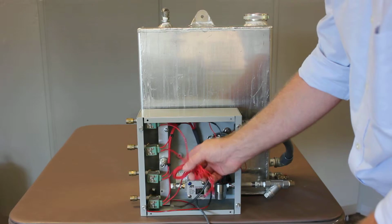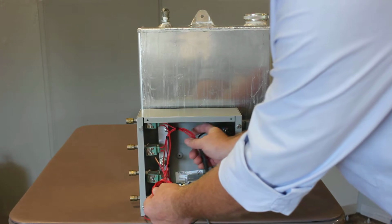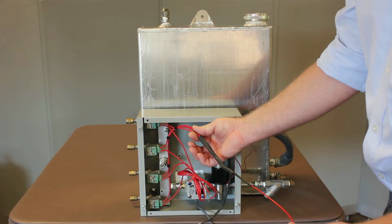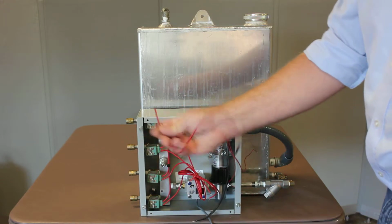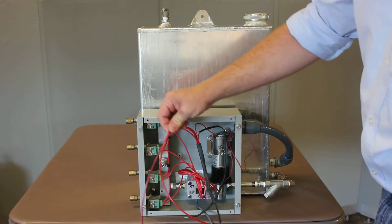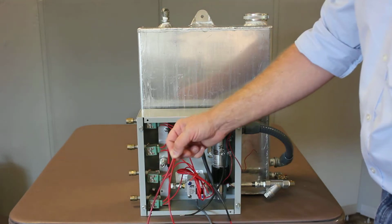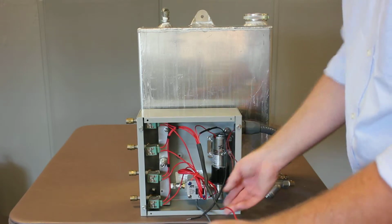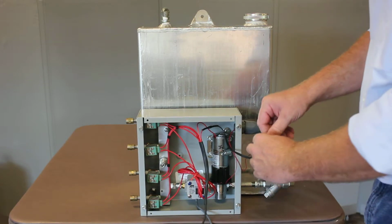And you're going to have all of these valves have two wires, they're DC. You'll find that we've already put together all of the valves and the red from the pump into this one red wire. So you're going to take your red wire from your controller and wire nut it to here, or however you want to make that connection, and this will just be a constant 12 volts. So yes, there's constantly 12 volts to these devices. The way we control the devices is by providing the ground or not providing the ground.